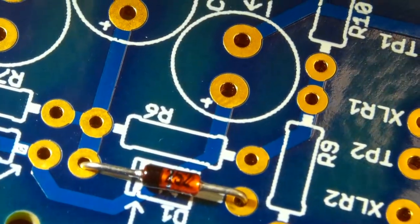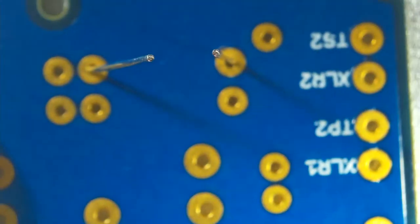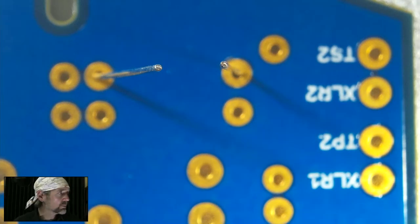All right, 252. Stripes are aligned. So then we start soldering. Now, this is a good time to answer the question that was posted. What's the ideal temp for the soldering iron? Talking about soldering temperature, I use 700.